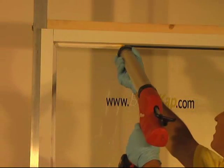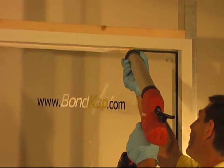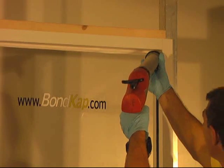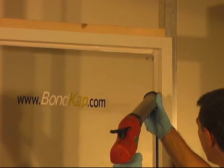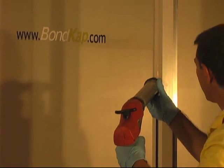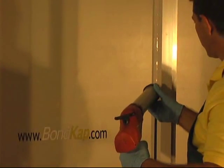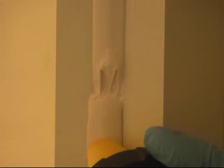In this segment, I am intentionally running a very thin bead. When you come to the end of a tube or wish to stop your run, wipe the tip against the frame before you pull away the gun to avoid running strings of silicone all around the building.